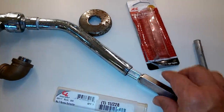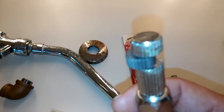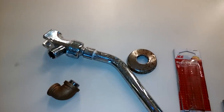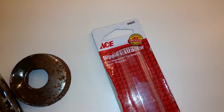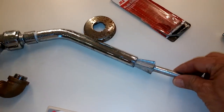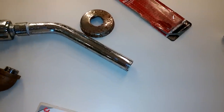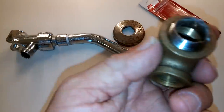The problem is the thin-walled pipe. You can see it doesn't fit — the half-inch nipple extractor only fits standard pipe, so the nipple extractor won't work. A PVC nipple extractor is soft metal; it doesn't bite into the brass or bronze.